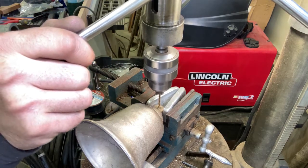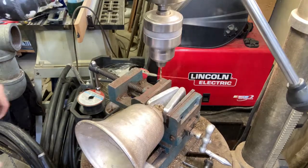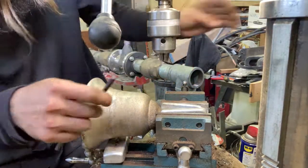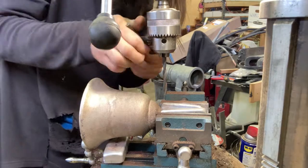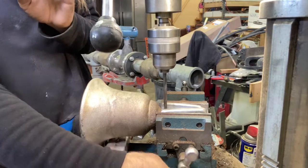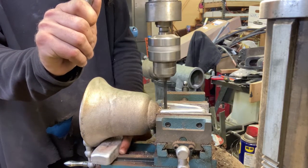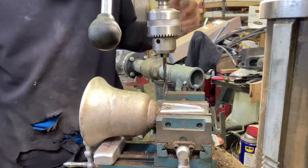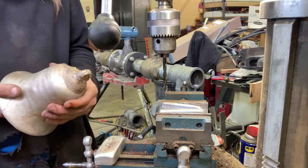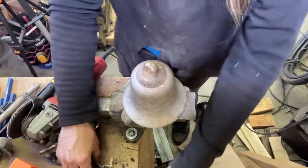Drilling bronze sucks. It is softer than steel, but it kind of sucks to drill more than steel does. It just tends to bite the blade and, you know, stop the drill and start damaging your tools. I don't know, maybe I'm doing it wrong, but it's just not easy. Something that has definitely helped is using these aluminum ingots for vice jaws. That is the best vice jaw I have seen yet in terms of function. And aluminum's cheap, so heck with it. Got me a few scraps.